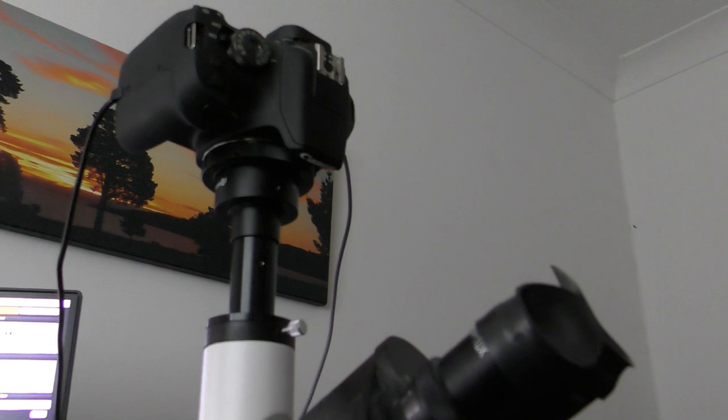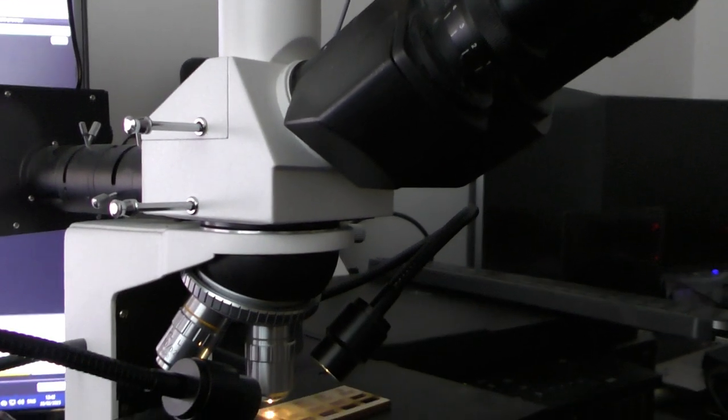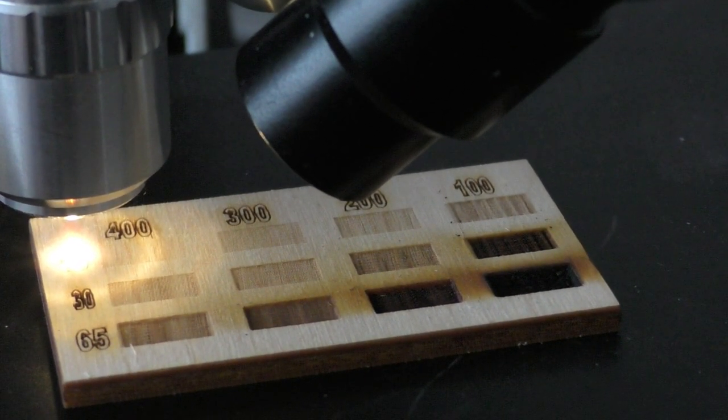Well, we're going to use my microscope now to do what I promised, which is to examine the surface finish of some of the samples that we've been dealing with. Now, one of the interesting things I want you to look at is that very intense light. It doesn't look very intense to you because the camera tends to blow it out, but it's a beam of light that's coaxial with the microscope. It comes through the lens and it's focused down to a spot that's maybe only 2, maybe 2.5 millimeters diameter. It's a very, very intense light.